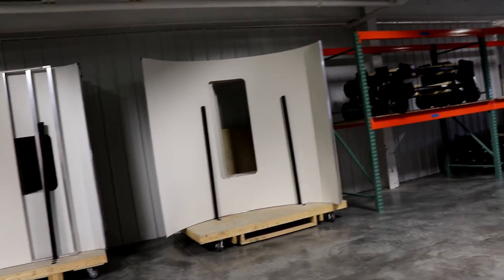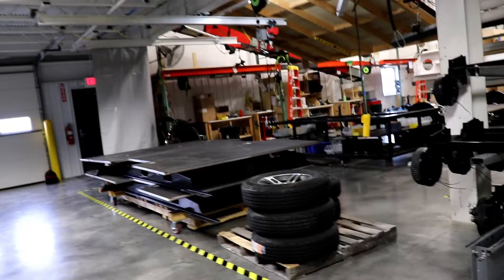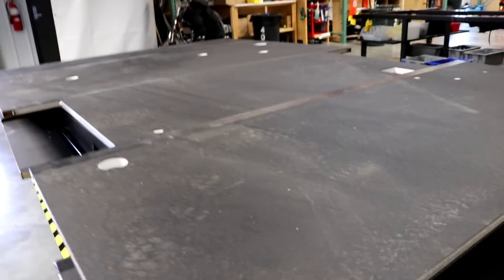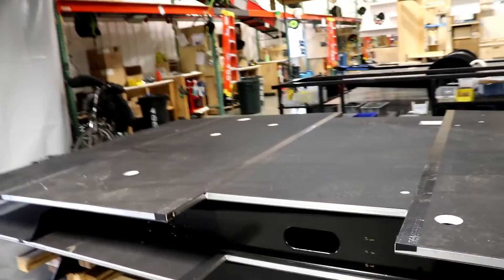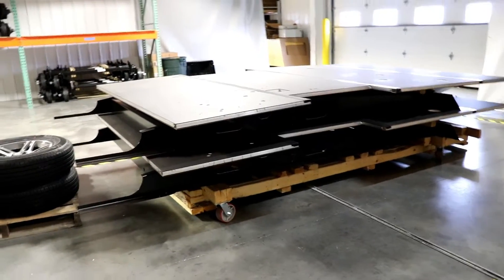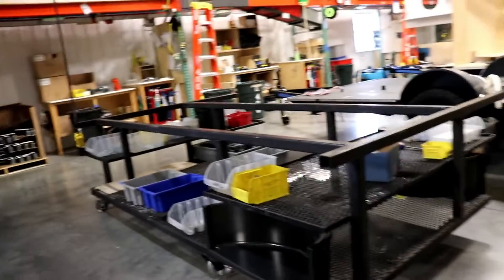At the beginning of the line, they start lining things up. You have your axles, your ceiling panels already made with everything in them. You can see earlier how it is a composite material on both sides — that's how they keep the moisture out. Notice how they're using the black tape to keep moisture from getting into the seams. One unit is already set up; they'll set a frame on top of this one, then flip it over and set it up to start working.